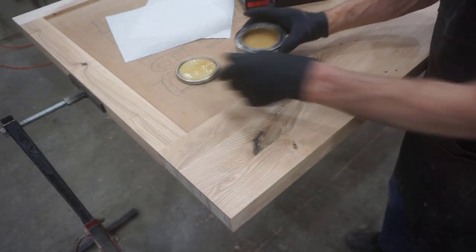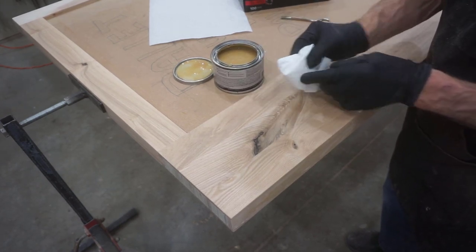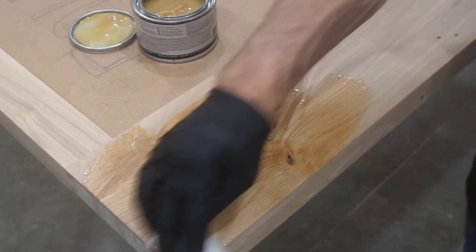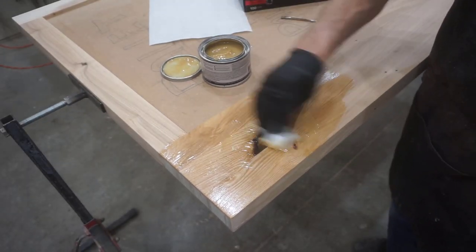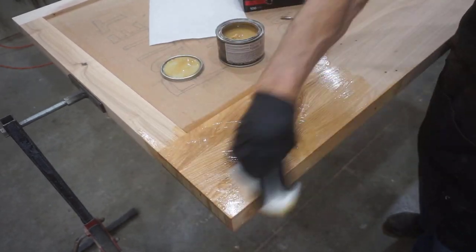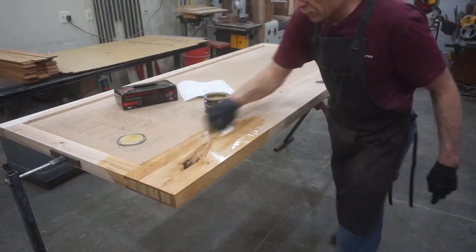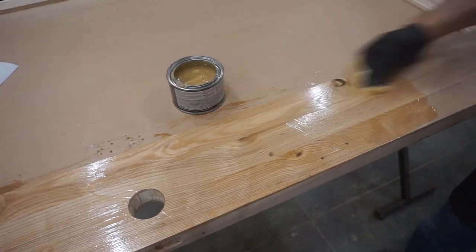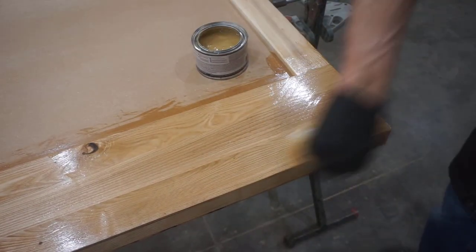In days gone by, it would be an absolute travesty to leave this kind of defect in the face of a finished piece of millwork, but in these days of natural grain, live edge wood, etc., this is just a perfect touch for a project like this. Gel poly comes in a thick, goopy state and applying it couldn't be easier — I just take a paper towel, dab on a big glob, and presto: instant magnificence. I'm just slathering on a very heavy coat, getting into the edges of the door as well, and I just put as much on as the wood will absorb. You gotta just love watching that grain come alive as I swab on this first heavy coat of gel poly.